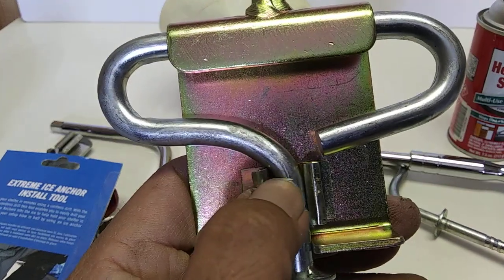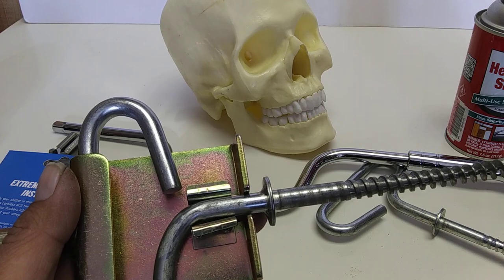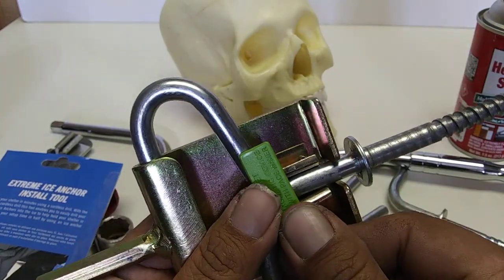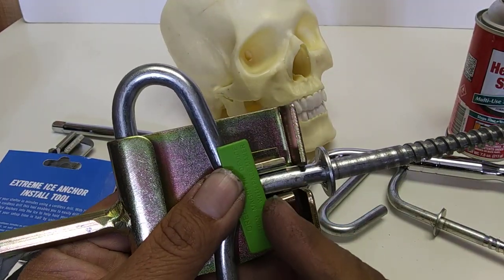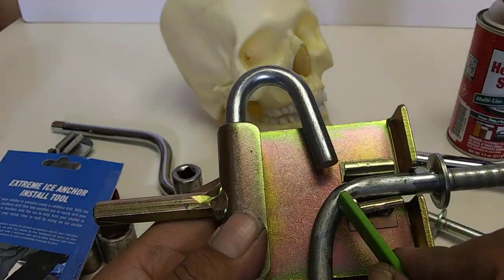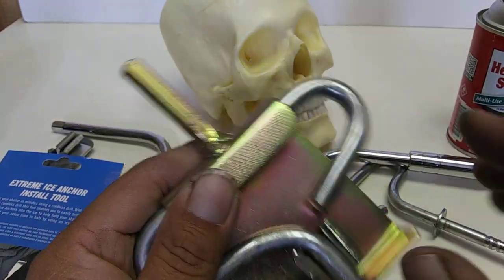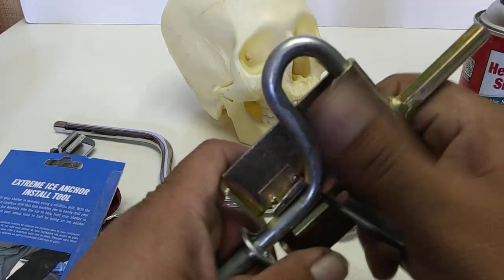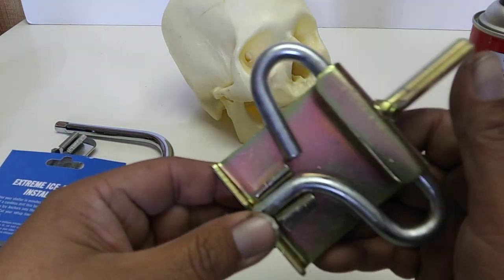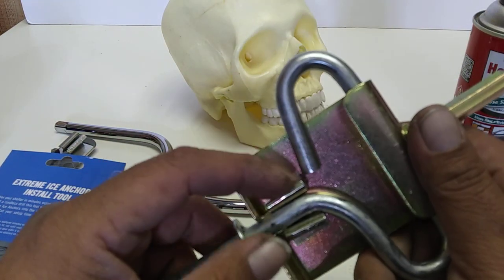If you want to make this a truly solid holding system, first of all you would have welded it rather than used pop rivets. You would have taken off that material right there and just made it those two pieces — that way you don't hit the arc. On each side you can flip this either way, but you're going to hit the angle right here, which is going to stretch that out. Things stretched out is never good. Flop it around the other way — it holds it secure, but that's going to cause havoc on those pop rivets and that thin metal, which is already bending out.